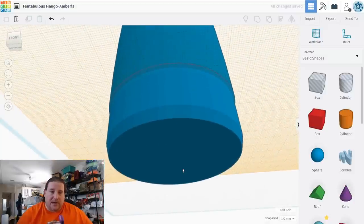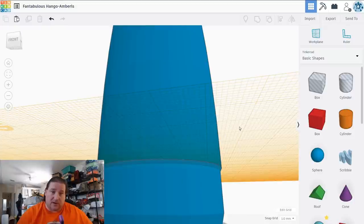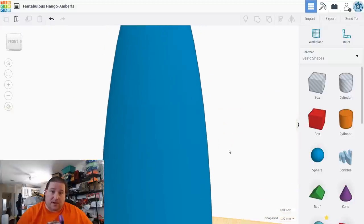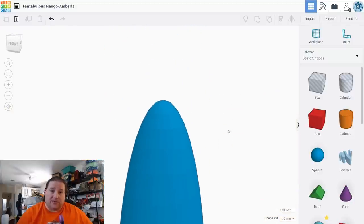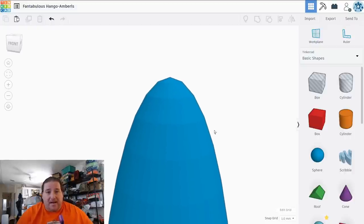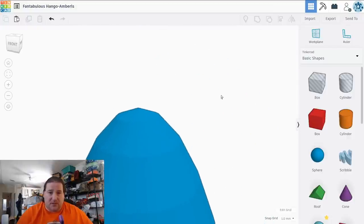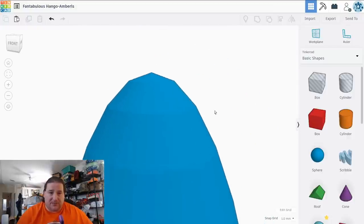I don't need to make a separate shoulder for this cone because I'm going to use a 1.2 millimeter nozzle to print it. So it's going to be a pretty thick cone. It'll be more than structurally sound. It'll also have infill to allow me to attach things to it. Now, here's the tricky part. To make this completely vase mode printable, I have to make some modifications here.